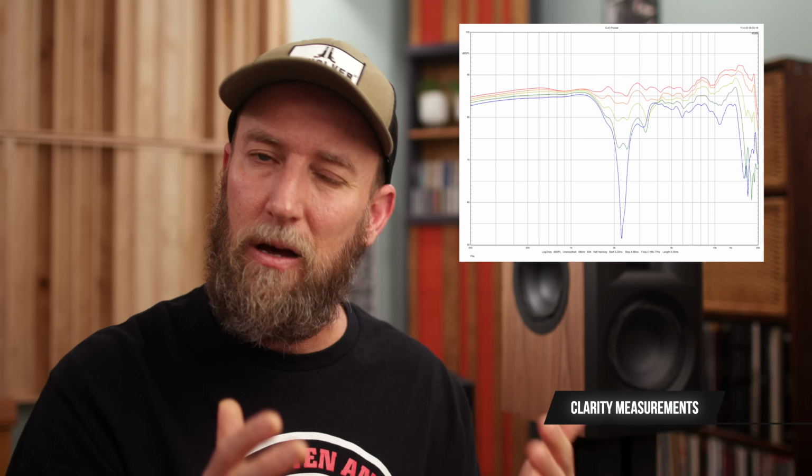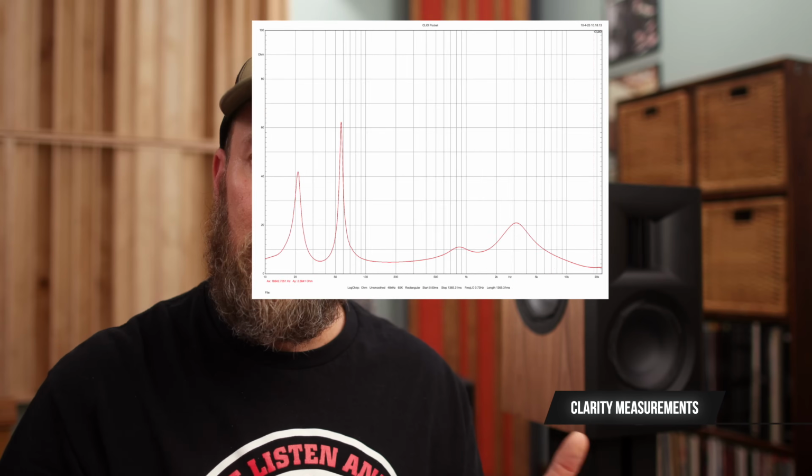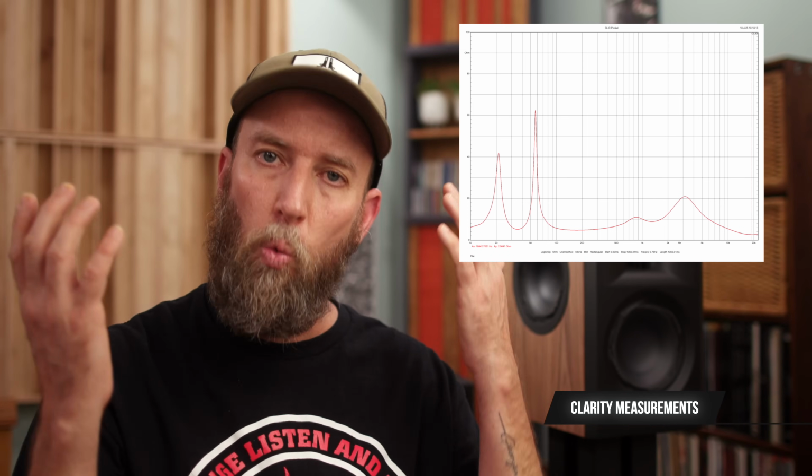And remember, they are crossing that tweeter pretty dang high, so I wasn't shocked to see a bit of a drop in the phase relationship, but all in all, this isn't anything to freak out about, and we have seen much, much worse in speakers that cost a lot more than the Clarity 6.2s. The impedance curve does show balance on both ends of the spectrum, and while I did take note of a drop down to around 2 ohms, it's so high in the bandwidth that it's not really an issue. Either way, what we're looking at here is a 4 ohm loudspeaker, 85 dB, so give it the firepower. You're going to need it with these bad boys.